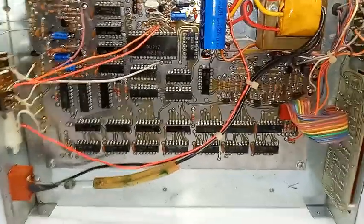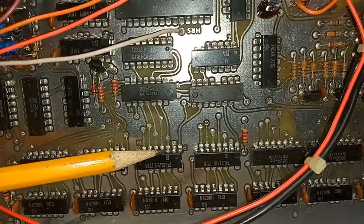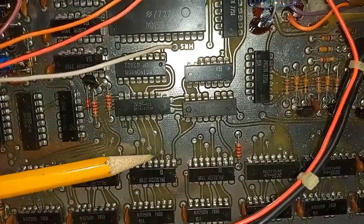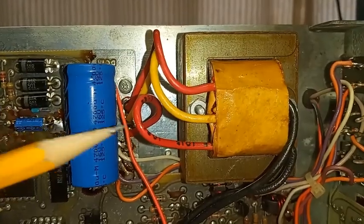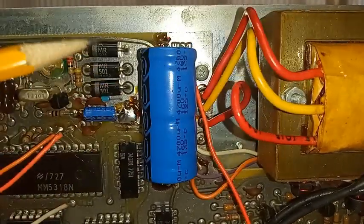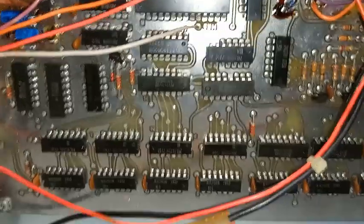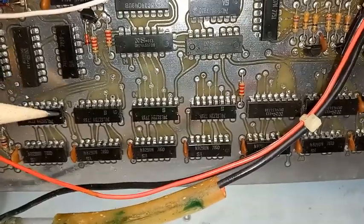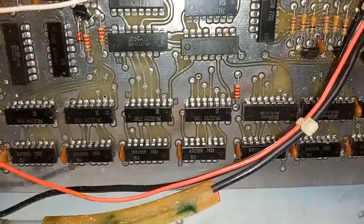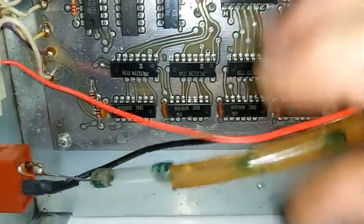Here's the top side of the BC-2000 with yet another wonderful circuit board designed by CPI, with a very functional circuit flow greatly helping the ability to troubleshoot should that need occur. We've got a fairly substantial power supply with some humongous three-amp rectifier diodes, a rather large filter capacitor — absolutely essential to feed this power-hungry TTL, also known as transistor-transistor logic. This was state-of-the-art technology back in the day. We've also got a two-amp glass fuse hidden under what used to be clear tubing here.